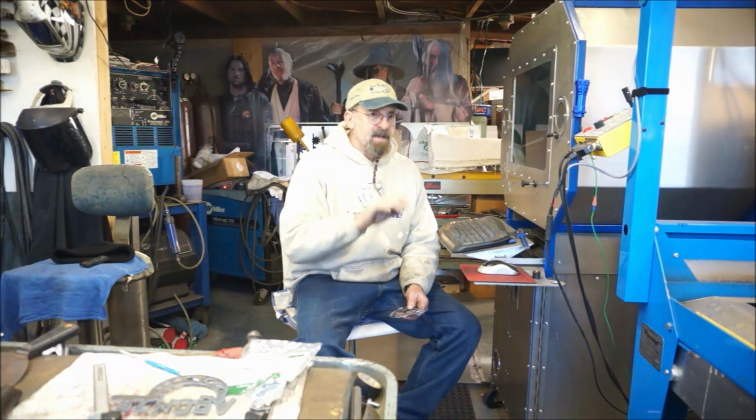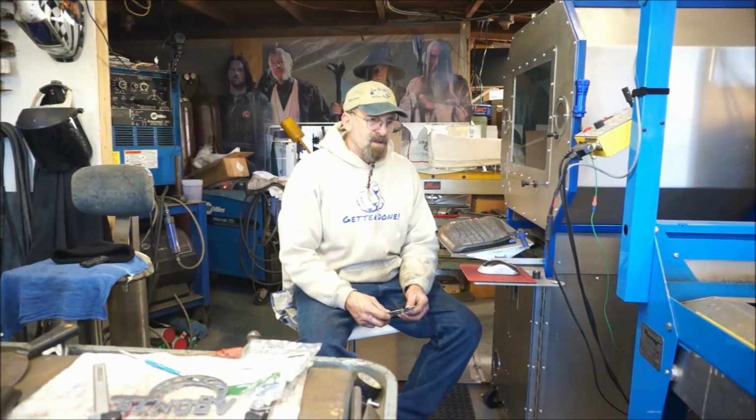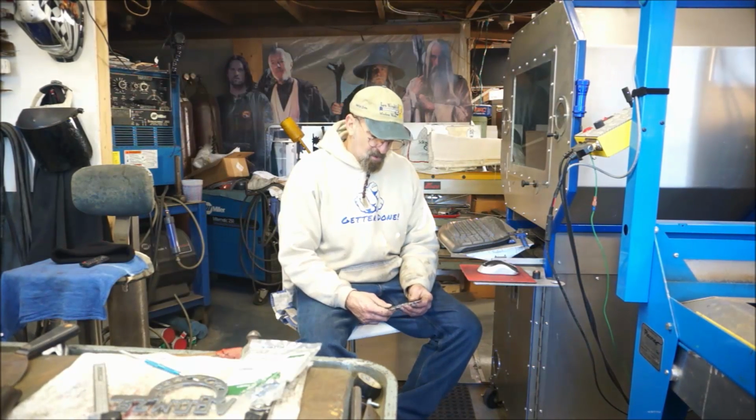After I get done cutting out some of these, we're going to go ahead and throw in a piece of cold roll finish, and you'll see the difference of it cutting just really sweet. I've done some other projects here, like my Cape Cod plant hangers and stuff like that I've done for the teacher across the street at the school. And it is amazing how much nicer cold roll finish sheets cut on the PlasmaCAM. Performance wise and cut edge and everything else, it really is quite a bit of difference between the two.